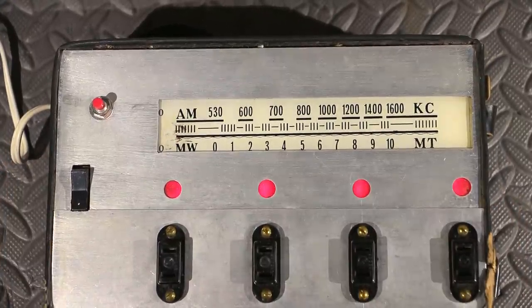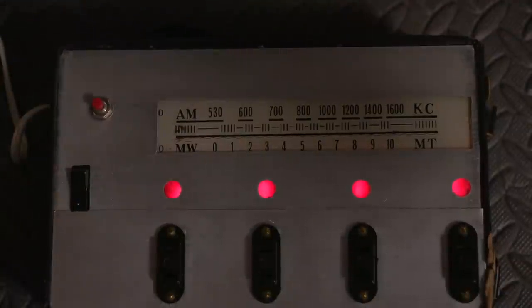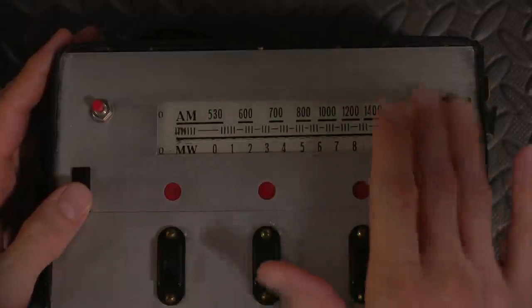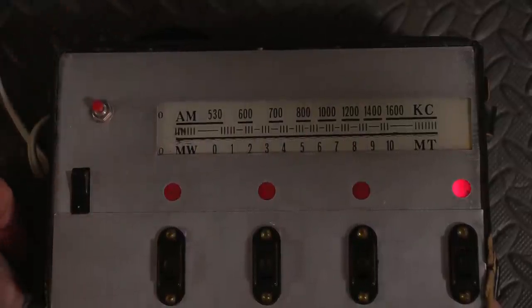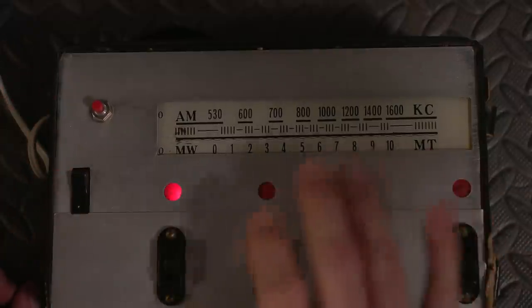Let's take a look at what it looks like through the front. I'll shut the lights off here and see what that looks like. These would obviously work — this would switch a load because this is the triac doing this. So if I was to plug an incandescent lamp in there of some sort it would trigger an incandescent lamp for sure, because the neons are lighting up full brightness here.